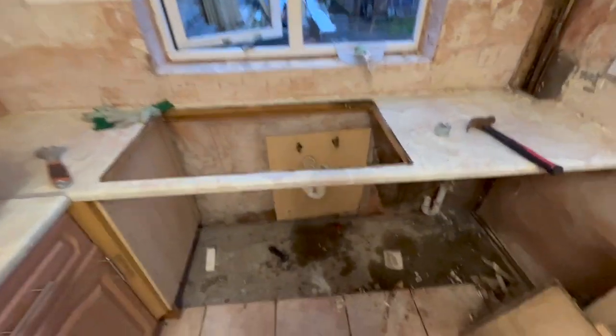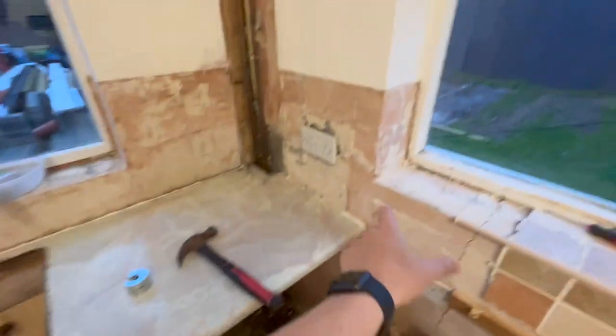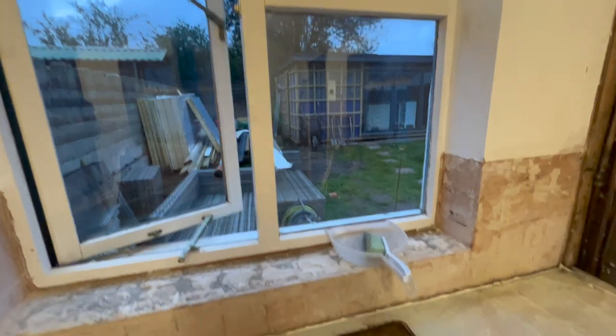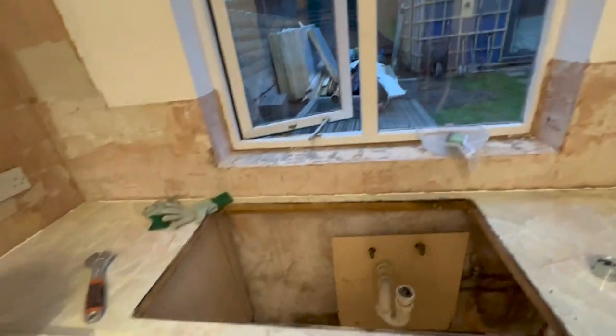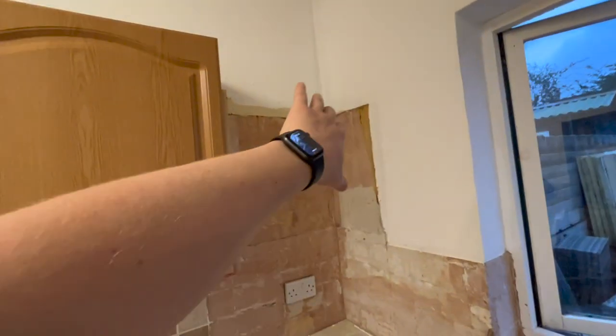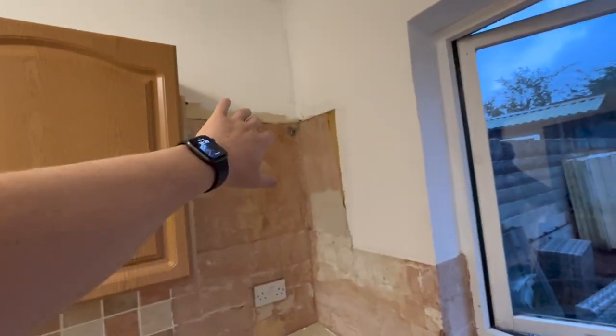And what I'm going to do then is on this slab right here, I'm just going to fly a timber wall straight through. And just like on the office up the back, we're going to just chuck OSB on the outside and just get it watertight-ish. And then I'm just going to wrap something around this corner of the wall to prevent moisture getting in through the neighbours. So yeah, that's the plan.